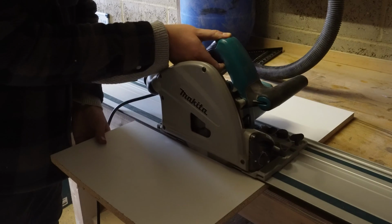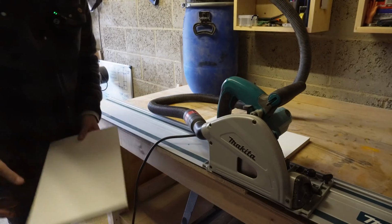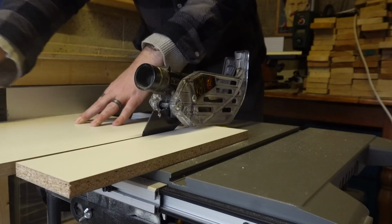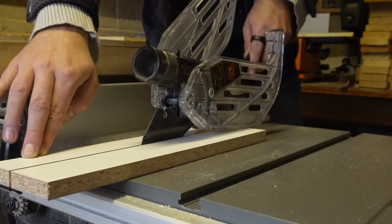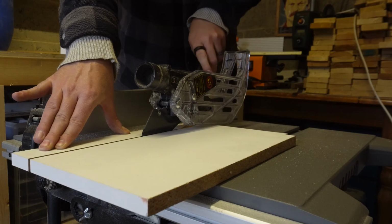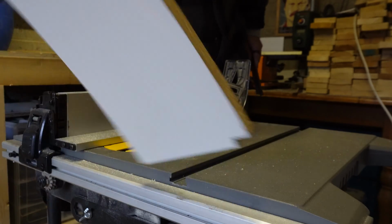Now the walnut's been rough cut and cleaned up, I can take those measurements and start cutting down the melamine to create the base for the form. I'm also cutting down some 40mm strips that I'm going to use for the walls of the form. The walnut pieces are only 25mm thick, so this gives me plenty of headroom in case I overpour the epoxy.